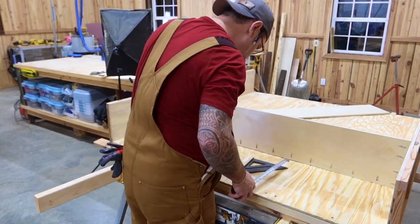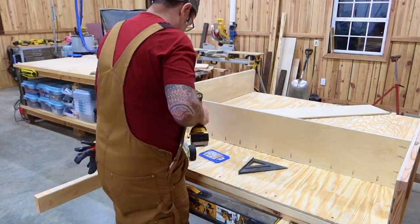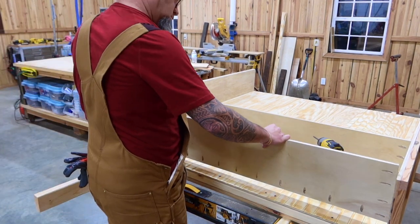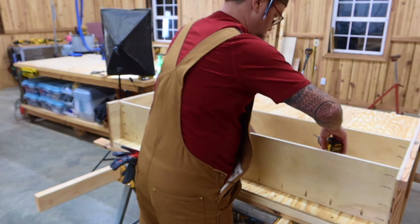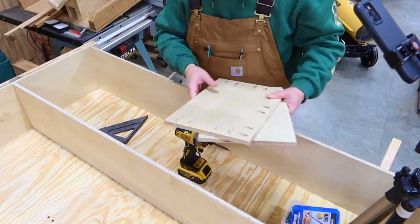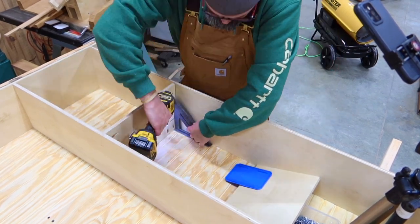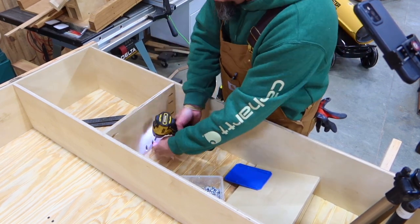To assemble the cubbies, I'm going to be using an inch and one quarter pocket hole screws. I got a little carried away on the amount of pocket holes — the recommendation is actually six to eight inches apart. I kind of overdid it, but overkill is not always bad. The second board we're going to be installing is going to be a mirror image of the first one. The spacing between these two boards will be 13 and three quarter inches. For the dividers, we're using nine and a half inch by 13 and three quarter material — it will not move at all.